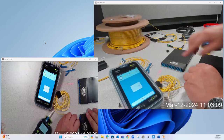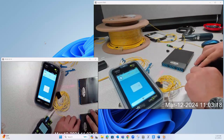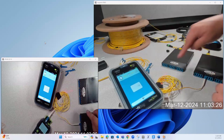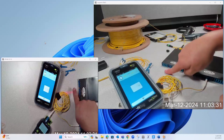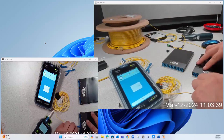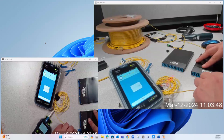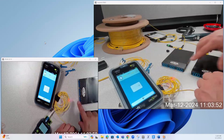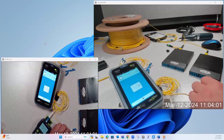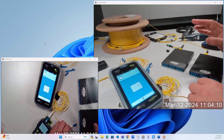Let's now check port two — I can see port two. Port three. And again, this would be a two-person job more than likely, though you could do it with one person — just more time-consuming. You'd be communicating that you're seeing light strong and on the right port each time you move down. I'm now on port six, fiber six. Then seven, eight, nine, ten, eleven, and twelve.